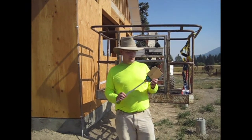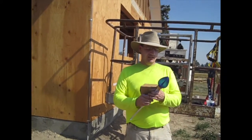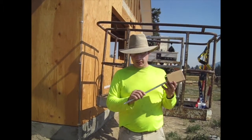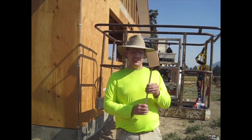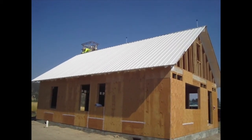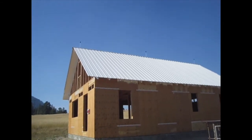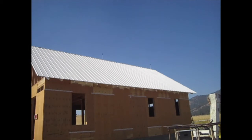I'm getting ready to put on the air terminals. I've already put on our glass toppers and made sure the screws are really tight because I don't want to have to tighten them up later. Until I get them installed I'm going to keep them inside the cardboard boxes for protection, then just go up and screw them into the brackets and make sure they're real tight. Here's a view from the front side of the building where you can see the three lightning rods sticking up — the cable is on the back side of the building.